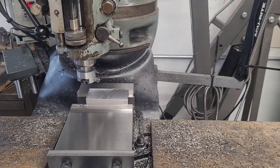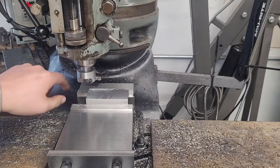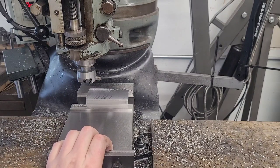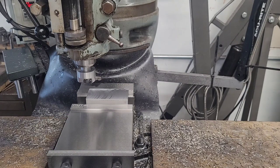I do use a lot of carbide here at low surface speed for it, but I'm very happy with that surface finish on this part — I think it's adequate for purpose. So you have real advantages on the small, light, basically tinker-toy machines where rigidity is a huge issue and you couldn't really even consider using a one-inch face mill.